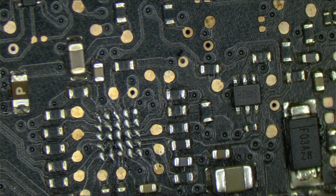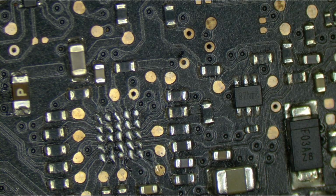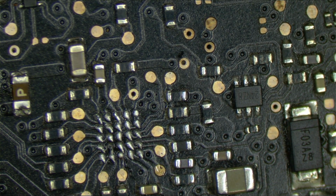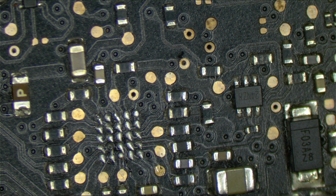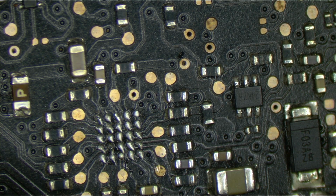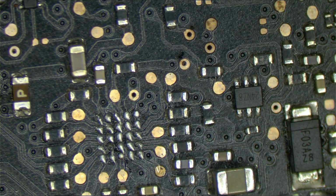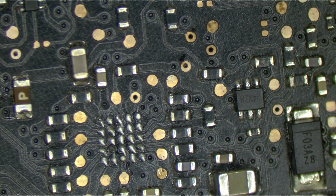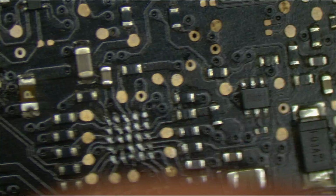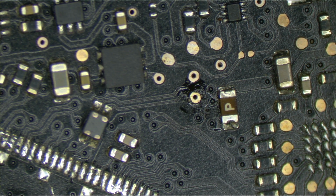Well, I mean, it could have been. It could have been the LED driver and something else. But most likely it is something else. But that's fine, because that chip is $1.61 and takes very little time to put back on. This is the thing, I don't even get easy no backlight jobs anymore. I can't remember the last time I charged for a fuse. I can't remember the last time I replaced a fuse. I can't remember the last time I had a no power issue that was fixable by replacing the TPS51125.